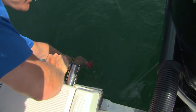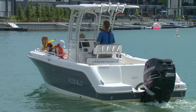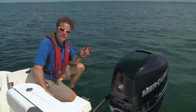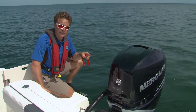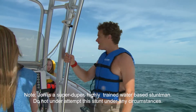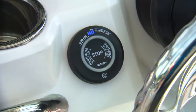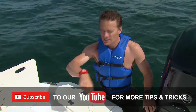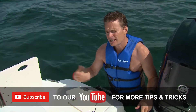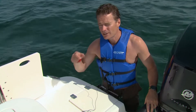This test should be done before you leave the dock for the first time to verify that it stops the engine in an emergency. To get the engine going again, you've either got to push the button with the person back on the boat, or hold the override button for 10 seconds to restart. We wanted to know how it really worked out on the lake, so purely for scientific purposes we tested one of these fobs in action. Well there you have it — worked like a charm. For just a few hundred dollars and 45 minutes of your time, you can add technology that can really change the boating experience. If you've got pets, it's nice to know that if they go overboard the engine stops right away.